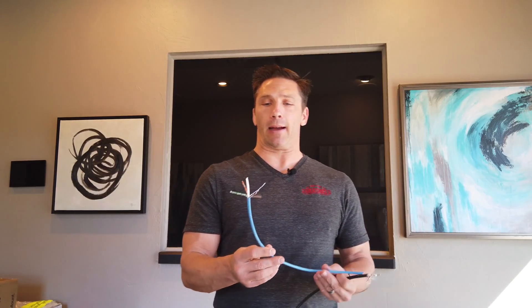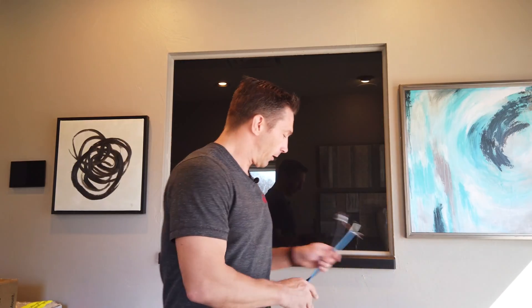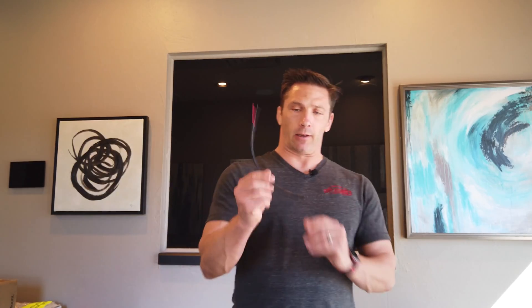Anytime we're running any kind of TV drop, TV location, or where main equipment goes, we usually run several CAT6 cables for control, internet, video distribution, and audio distribution. You can't go wrong by running extra CAT6. And of course there's speaker wire — typically 16 or 14 gauge depending on the length of the run from the amplifier to the speaker. Two conductors per speaker, positive and negative.